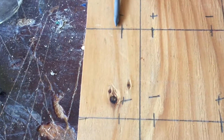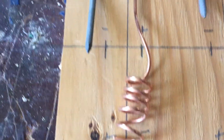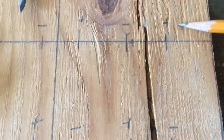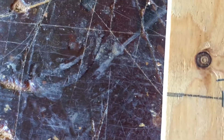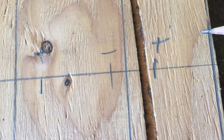Before drilling any holes we have to mark out our board. In the upper left hand corner we're going to have a negative and a positive, then jump over with a negative and positive all the way across on the first row — these are going to be in series. From the upper right hand corner you have a positive going to a negative on the second row, going to the left in series, then we jump down from a positive to negative in the lower left hand corner and work our way to the right, ending with a positive in the lower right hand corner.